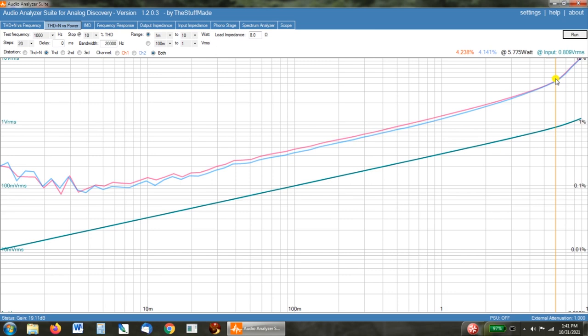What the analog scope doesn't show you is these other THD numbers. And for you folks that are curious, at 1% we have right at 1 watt. So again, this isn't a super clean amp as far as the THD goes, which I'm not surprised. But I do want to do a couple of other tests at the end of this and show you what different driver tubes and what another lower voltage rectifier tube does to these numbers. And I'll put together something that overlays those so you can see what we're talking about.